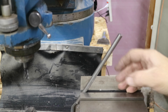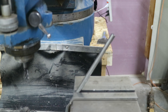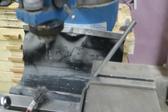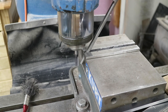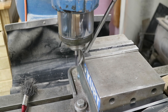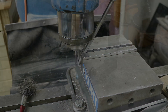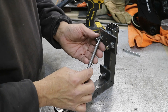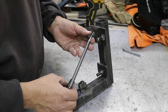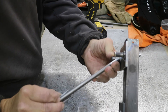This vise has already been set up for a three-eighths tube, and this is a three-eighths end mill. We're right on center — we will be once I zero it out. Back at the fixture, I'm going to take that end, put it on the standoff, and check the angles. I can see that it fits really nicely on there.